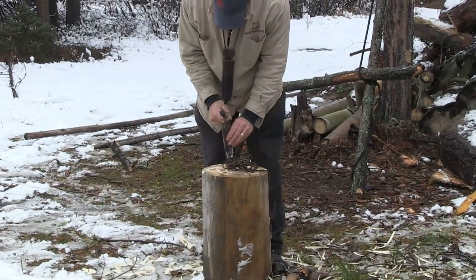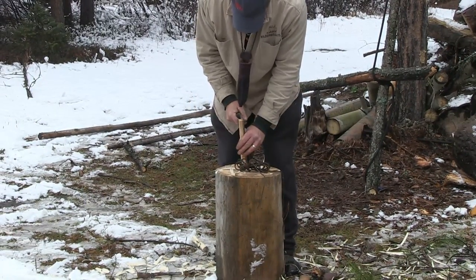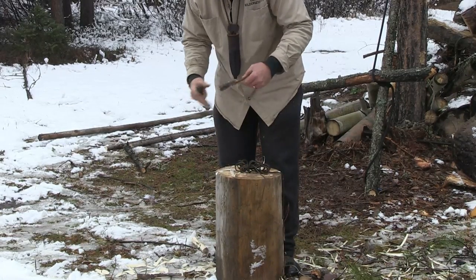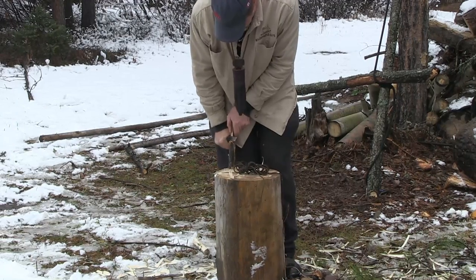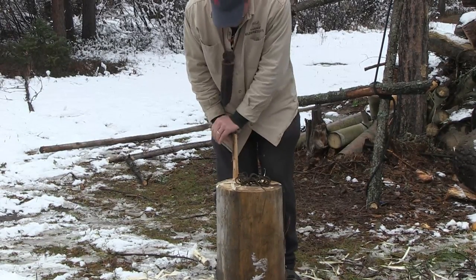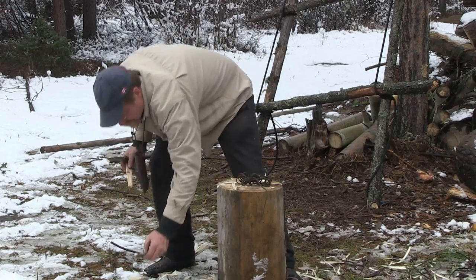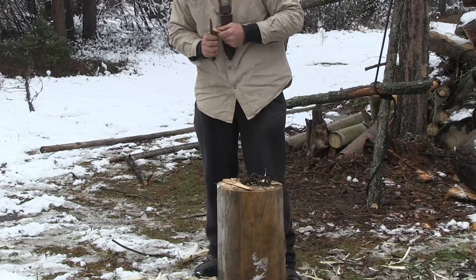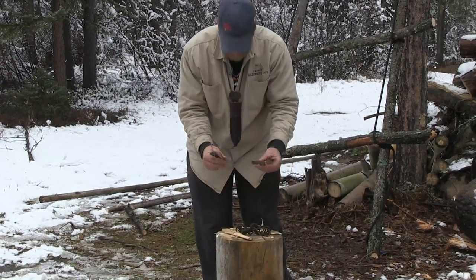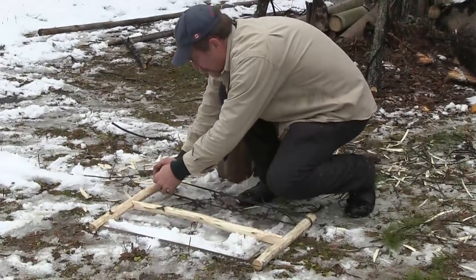Kelly is dressing down a piece of suitably strong wood to wind up the strings, which will be wound up until the proper tension holds the whole saw together. The stick can't be too weak or it'll break as you wind it, and it can't be too cumbersome or it'll haunt you the whole time you're using the saw. There is always a parameter — a limit — to everything: things can be too heavy or too light, too long or too short, too brittle or too soft, and your experience guides you and eliminates a lot of these variables.